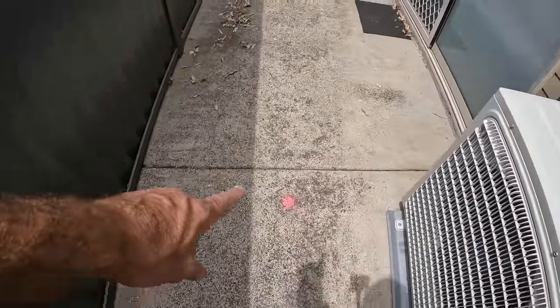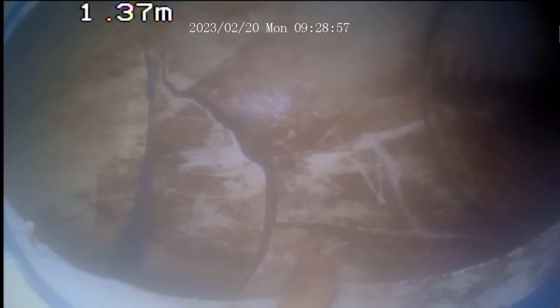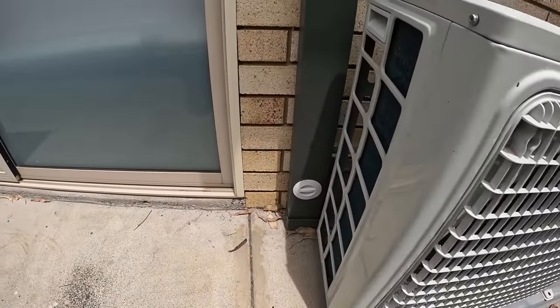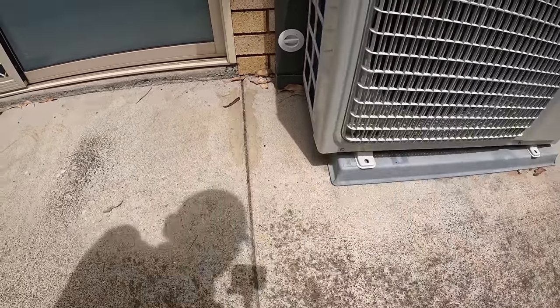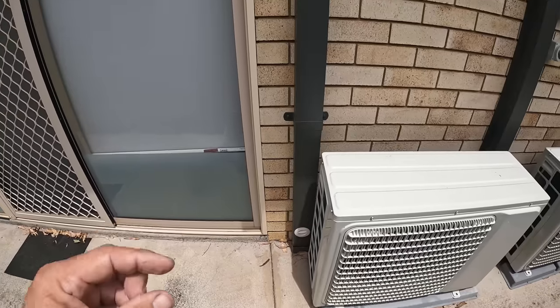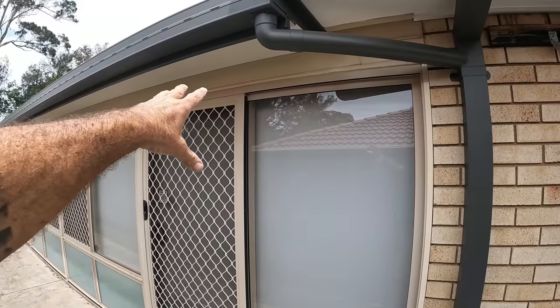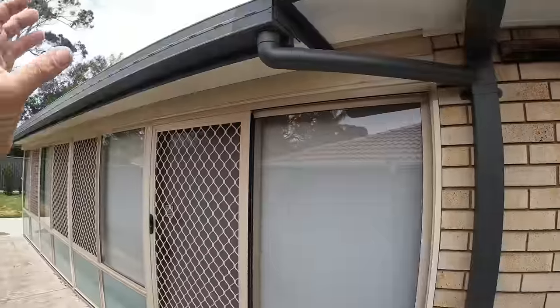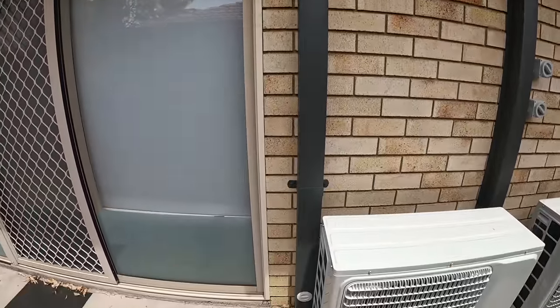Meters, there's a crack on this junction. That's the 19 meter mark where the junction's cracked on the stormwater. Then we just flicked the camera through that downpipe to check that branch line to make sure it's all good, because one of the problems she was experiencing is this little outdoor area, water's getting in back there and overflowing. So she thought there could have been a problem in here, so we've just checked that for her.